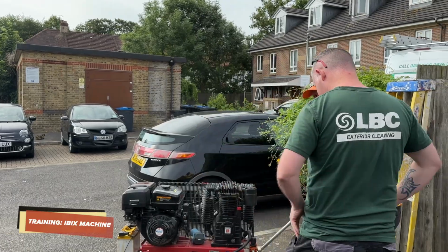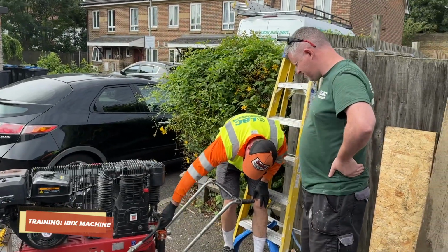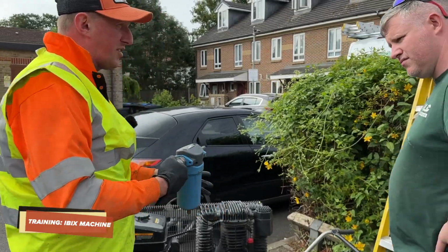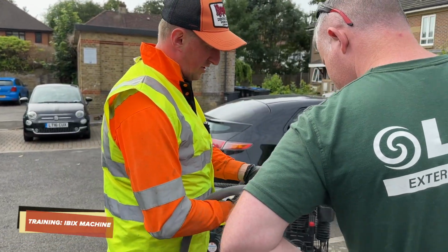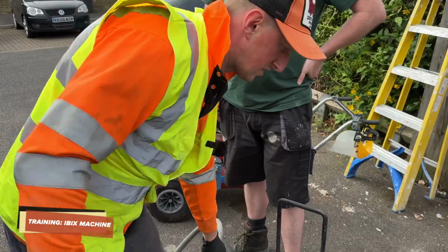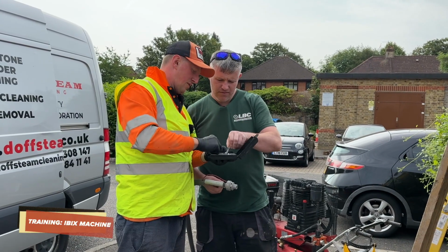To change the pressure, it goes up to 7 bars. Pull up and down, because every meter, every length of the hose, drops 1 bar. Inline dryer, okay. Plug in. To start, press the trigger; to stop, let go of the trigger. To change the nozzle, take this one off, because you've got a few different nozzles: the 2.5 and number 4.